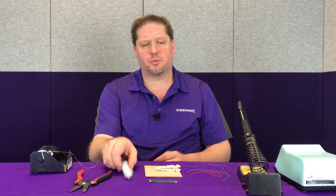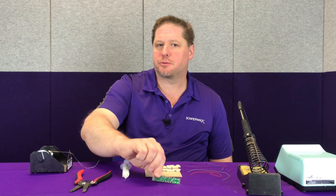Of course, we're also going to make sure that we use a solder flux. There are many types of different fluxes out there for things like pipe fitting, brass model building, and all those kinds of things, but you're going to damage the decoder because all of those types tend to have a higher acidic content. So when you purchase a flux, you want to make sure that it's designed for work with small electronics and small printed circuit boards, so that the design of the flux is for the work that you're about to do.